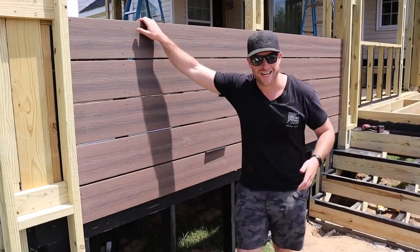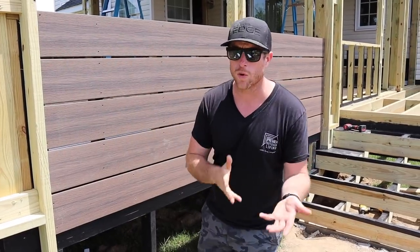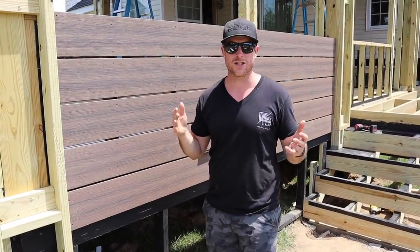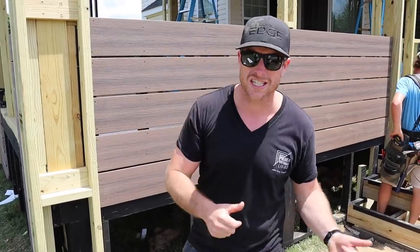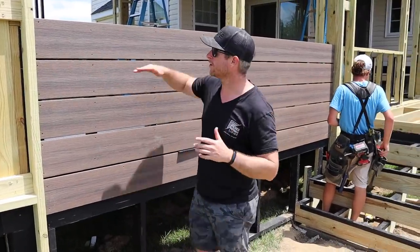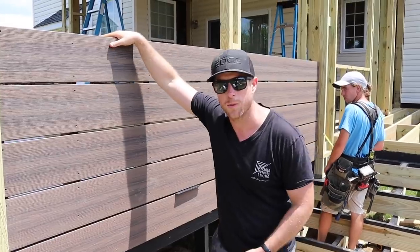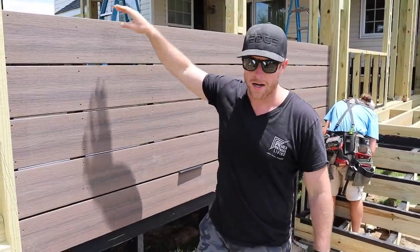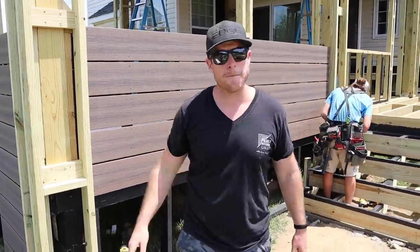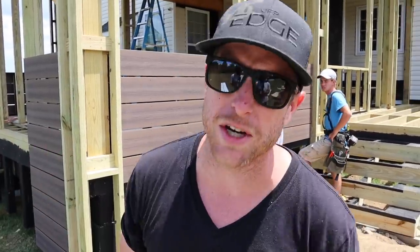On the outside you can see we got these decorator boards going up. We're using the seven and a quarter Kaya, and we use those seven and a quarters because we do a seven and a half inch rise on our steps, so these boards can just go right into our riser and it leaves us with a quarter inch gap on those stairs - it looks really nice. We figured it out so that starting here, we're right at our framing, it's going to line up with our stairs, and we made this knee wall 30 inches high so with that quarter inch gap we're flush with the framing and we can do our cap on top. You're going to have to wait for the next vlog to see the rest of this decking going in. Make sure you hit subscribe, and until next time, this is Premiere Outdoor Living.